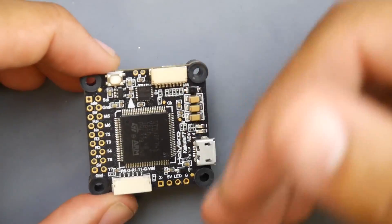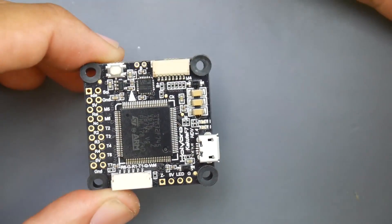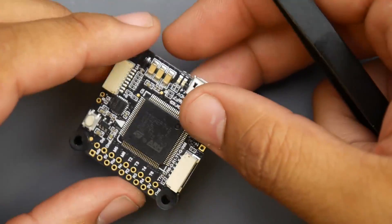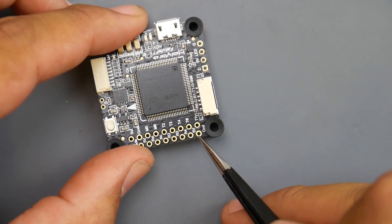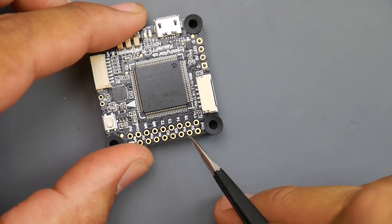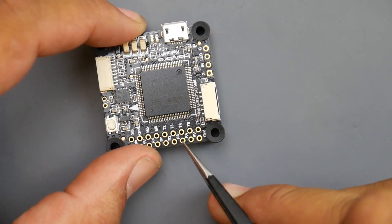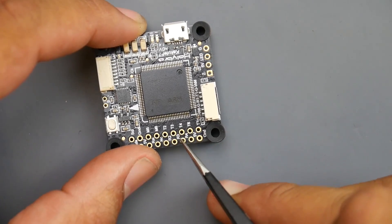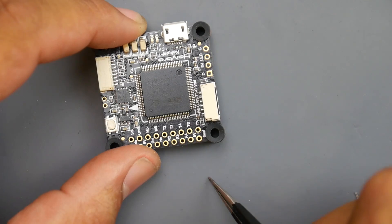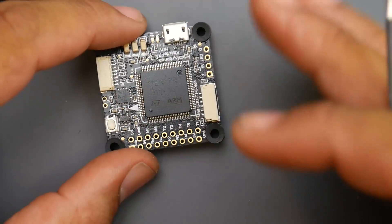If you're running IBUS or SBUS, sometimes they don't always work on the same pads. However, when you're rocking an F7 microcontroller unit, you can put them on any R pad. For example, whether it's IBUS or SBUS — they're usually 5 volts — here we have a pad for ground, where I'd put the black wire for my receiver. Next is 5 volt, where I'd put the red wire. Above that is the R4 pad, where I'd put either my IBUS or SBUS. Then I'd go into the Betaflight ports tab, find UART 4, leave everything off except serial RX, check that, save, and you're good. Then go into configurations and choose SBUS or IBUS.